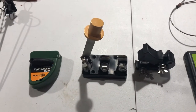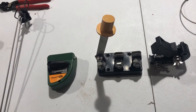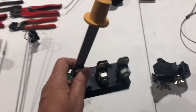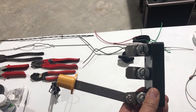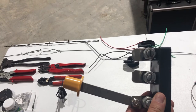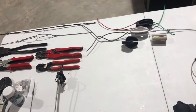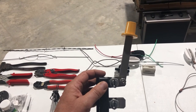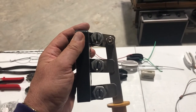Here are some shutoffs, and note that there are different kinds and different colors. I would suggest finding one that you'll be able to see — that's why I like this middle one with the yellow handle, because you'll be able to see it from a distance. Always mount it so the handle does not point straight up, because if a bird sits on that handle, it comes down, hits those little fins, and all of a sudden the fence is hot and you're tangled up in it. Not a good thing.